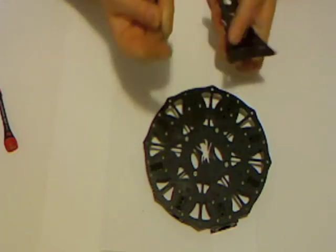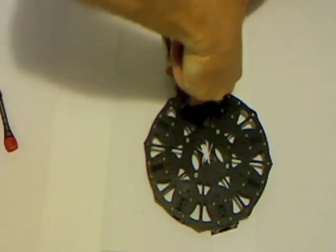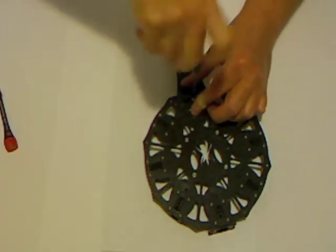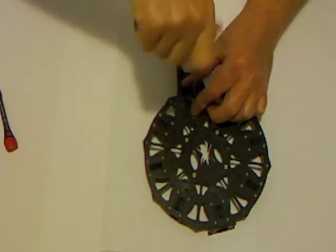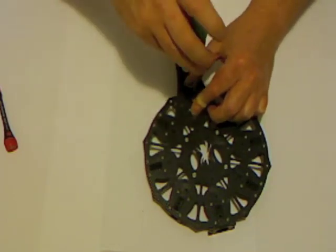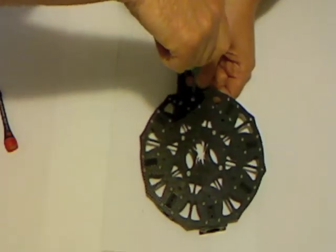and screw the tail into place. That M3 screw goes into the block itself. Okay, it goes into one of these threaded studs that are in the block, and I'm using the center one. You've got 3 to choose from. You could use any of them, doesn't really matter.